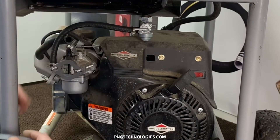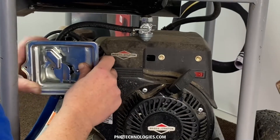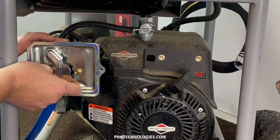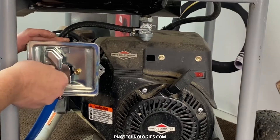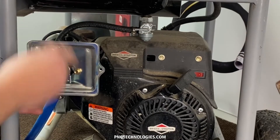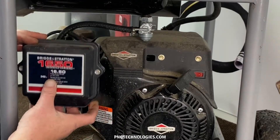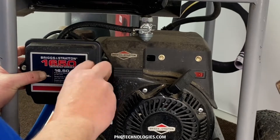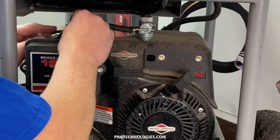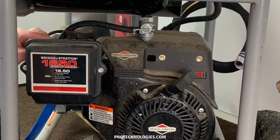Now we can go ahead and make sure our gasket's on here and put our slim adapter on. Your gasket's already on the back of this — go ahead and get that up. You can see now that you have plenty of meat to get the nuts back on. Tighten these up, then go ahead and get our air cleaner back on here with the filter in it. We'll pop our choke back on there. You can use that for the gasoline — you don't want to use it for the propane or natural gas. Make sure you install your air tube breather back in here.